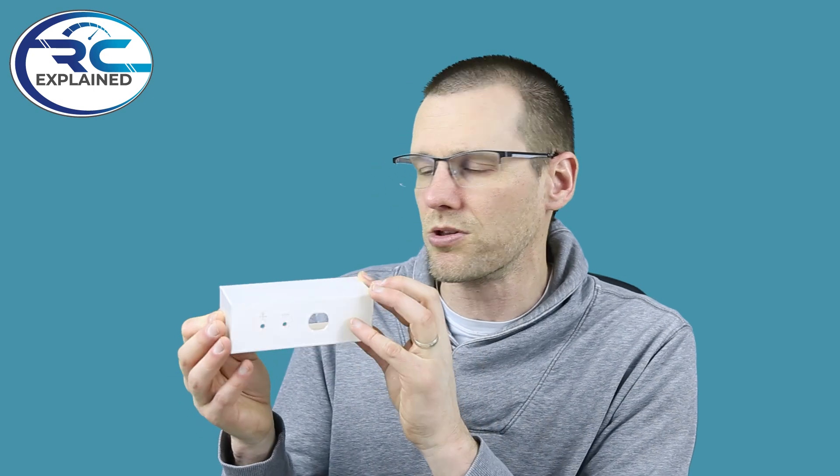Another thing you'll want is some kind of front cover. If you have the skills, 3D print a piece. If not, you could make something out of wood, maybe 3/8 inch, in this sort of box shape that bolts in with the holes on the side. On one side we have a strain relief hole — we pop a strain relief in there so we don't end up pulling the power cord out from the supply while it's live. We want to prevent that from happening.